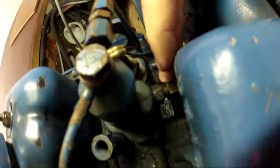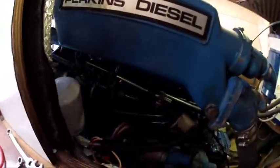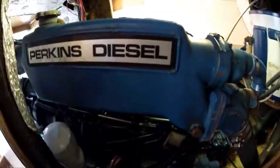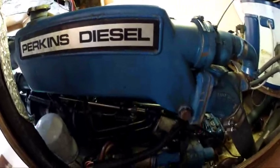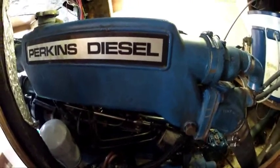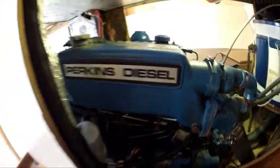Then I came up over here and loosened these nuts over there — you'll find them on each of the injectors. I ran the engine for about 30 seconds and it didn't start, so I just opened these up again and bled the injectors again. I let it run for about a minute this time and then closed them all off.